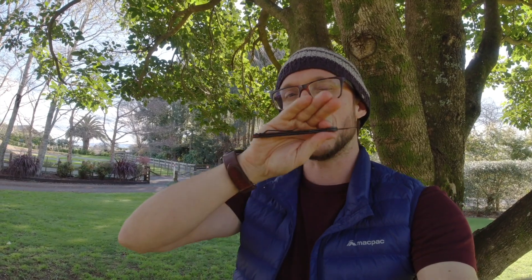So I wanted to give some tips from my experience. When I tried using 400 or 600 grit, the larger pieces of abrasive put so much pressure as they pass by the apex that they actually chip out big chips. In a tungsten carbide knife, your goal is to chip really, really small. You'll always have an apex that's somewhat chipped, but you want to get it thinner and thinner. The best rule of thumb is to use a lot of strokes, really light, with fine abrasives. I've heard a lot of guys have good luck with buffing wheels on grinders because it goes so fast you can put a lot of distance across the edge very gently — things like that are going to be your friend.